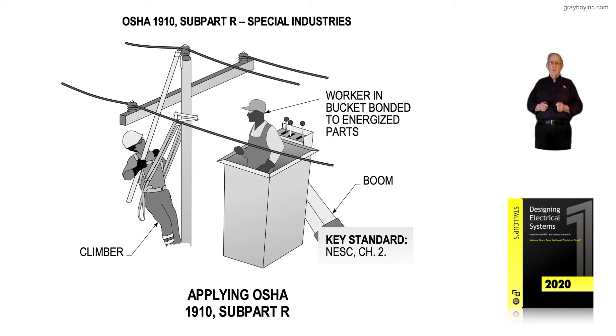Notice that the worker in that bucket truck, if he makes a closer approach than 10 feet — or what is listed in OSHA 1910.269 tables S1, S2, S3 — that individual needs a face shield. The individual might even need sleeves and rubber insulators depending on the voltage, but a face shield is required in most conditions.